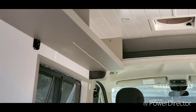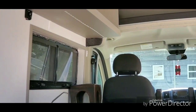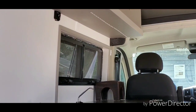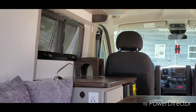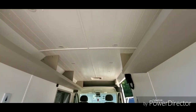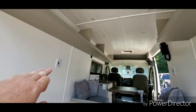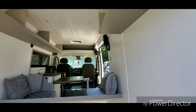I did put an LED light strip right above the countertop, with a switch right there that she can turn on whenever she's cooking if she needs a little more light. We ended up going with 10 LEDs in the ceiling and they are on dimmers. These four here run off of this switch, and the six up front run off of this switch over here by the other little seating area.